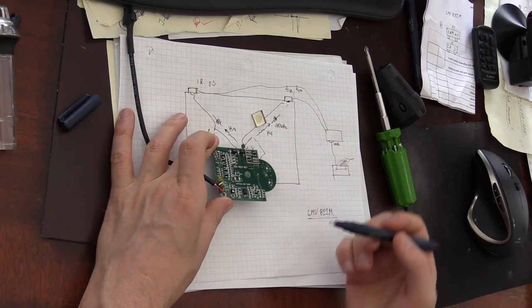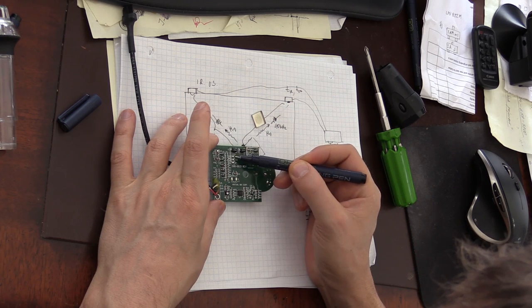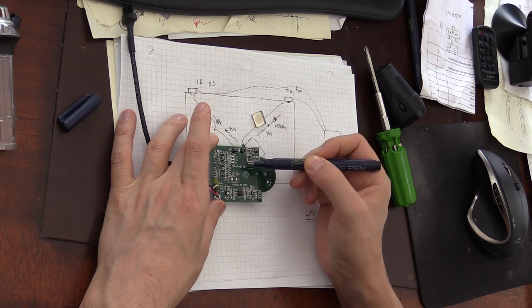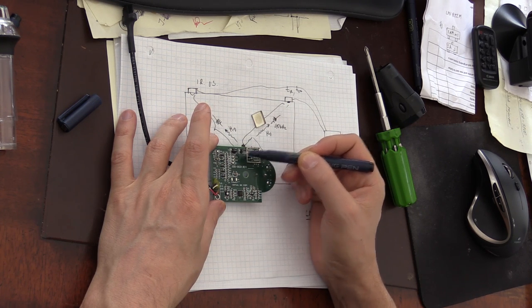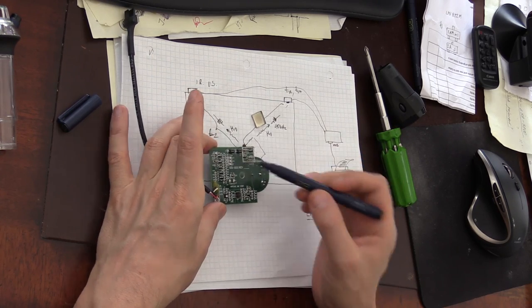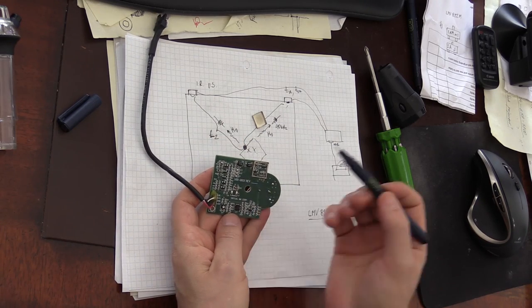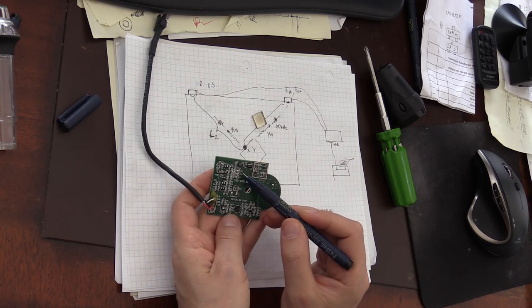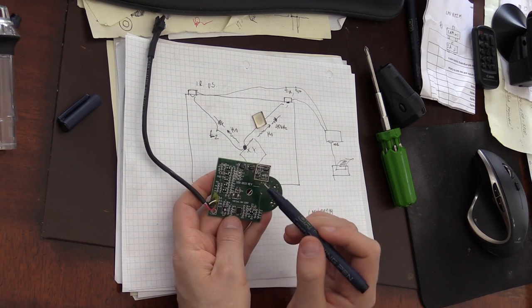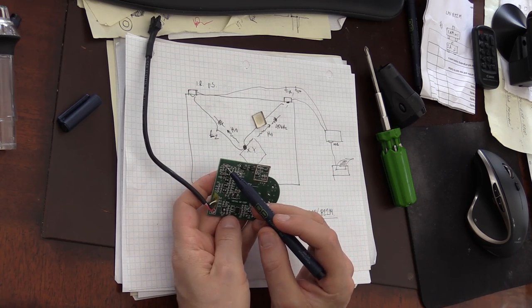Another interesting thing that I noticed is that they used four capacitors. Those are not ceramic capacitors, those are film capacitors. These are low ESR capacitors, to my knowledge, and low inductance capacitors. You can see they look kind of silvery right here. I've used a slightly bigger version of these capacitors in my own designs, when I really needed low ESR, low inductance capacitors. That's when I used them, and you can see they have a kind of silvery look.